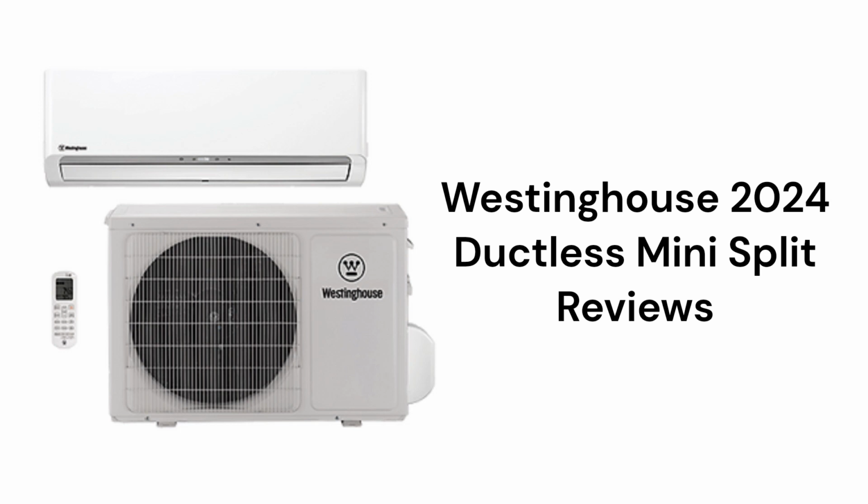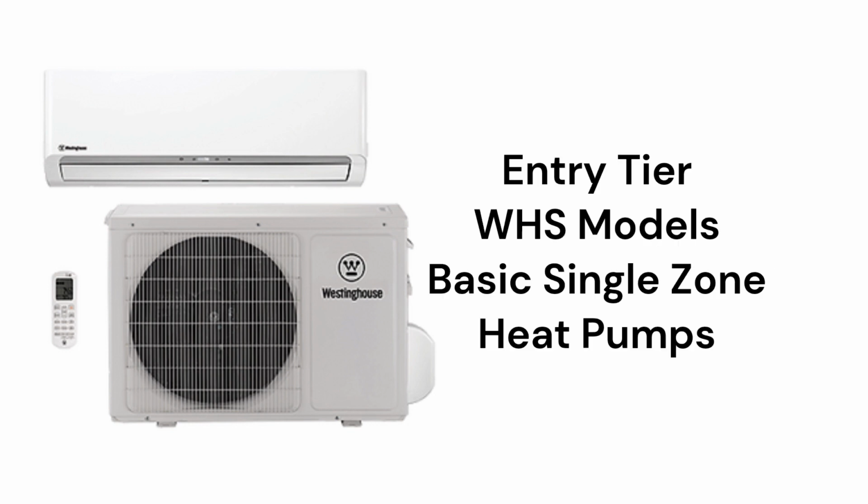This brand is made in China and is available in the USA through distribution by Fujitsu General America. The units use basic washable filters that do not do much to keep the unit clean or to improve the home's indoor air quality. The Entry Tier WHS models are basic single-zone heat pumps that are available for either 115-volt or 208/230-volt electrical power. They use old rotary compressor technology and have a 16 SEER2 efficiency.